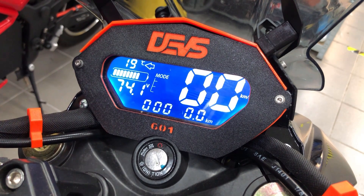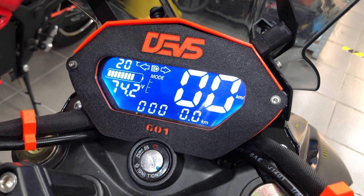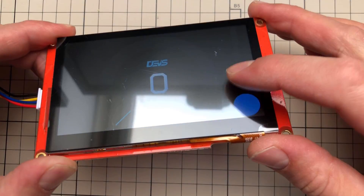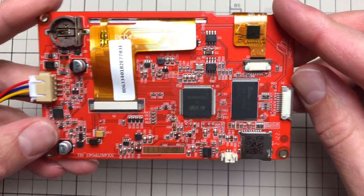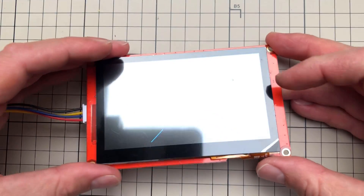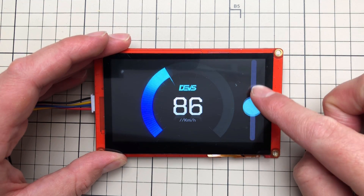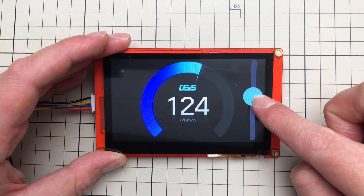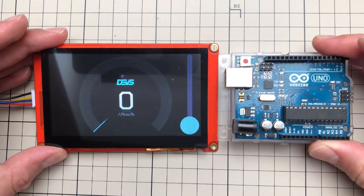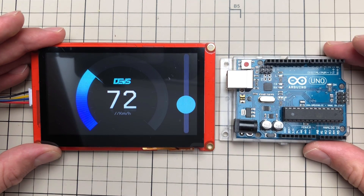Driving a color LCD is too much for something as simple as an Arduino, and since there isn't much time, instead of learning a new microcontroller I've decided to go with an intelligent display. The best example is the Nextion display. An intelligent display is not only the display itself — it's coupled with a touchscreen and a dedicated controller responsible for drawing everything on screen, as well as controlling simple logic like buttons, checkboxes, screen switching, or sliders that set the value of an animated gauge.